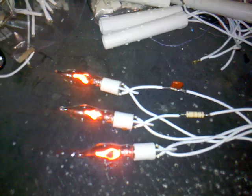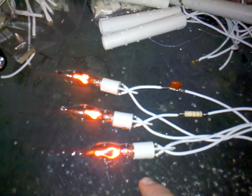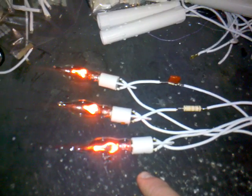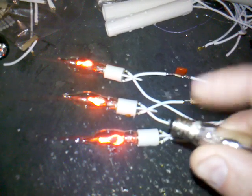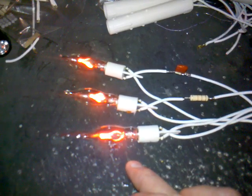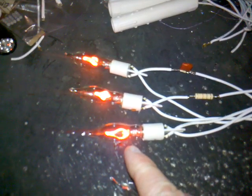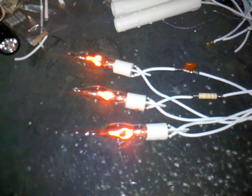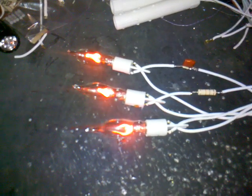One of the things about these is that they tend to run them at maximum power to get as much brightness out of them as possible, which to me shortens a lamp's life. In the base of each of these lamps is a small resistor and it gets very hot. These lamps are running on 240 volts — I measured the current and this one here is drawing 6.2mA, and typically the resistor will be dropping probably at least a quarter of that on 240 volts.